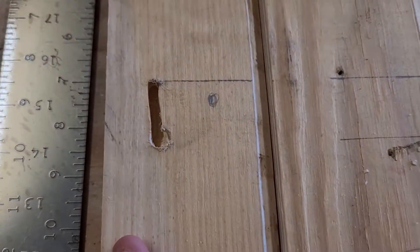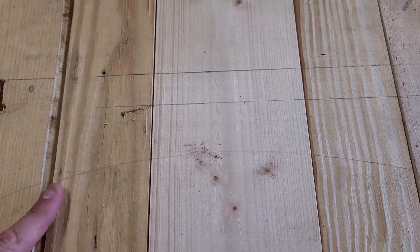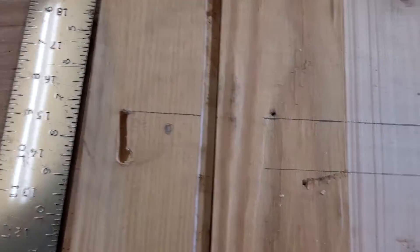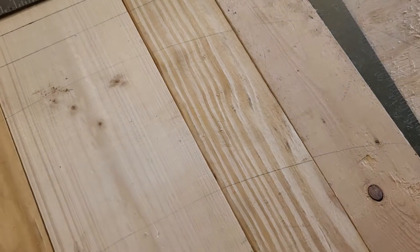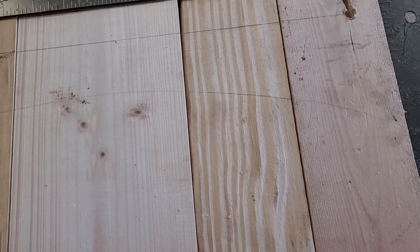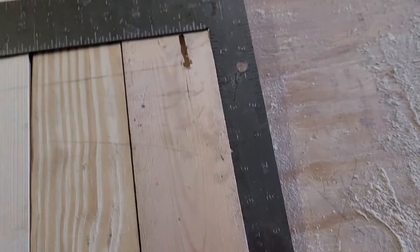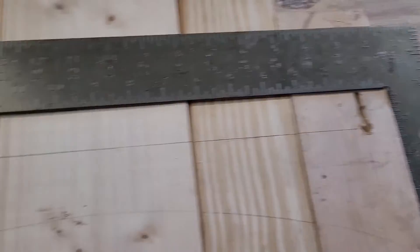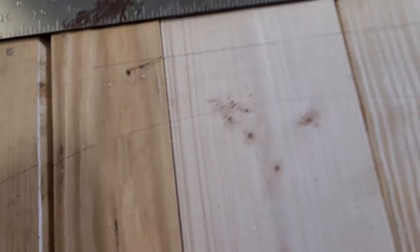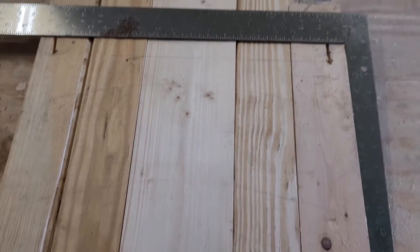They are just a little bit crooked, but at least they slant the same direction, so that won't cause any issues when it comes time to hang it up. I'm not going to video me doing the keyhole slots on the other ones — I'm sure there are other people on YouTube with much better videos of that. All I did was use a big square, making sure everything's squared up on the sides after running through the table saw, then just scribe a line all the way across so your screws will be at the same height. Then I drew another line to show my orientation, because I'm sure these will get moved again before they're glued and screwed.